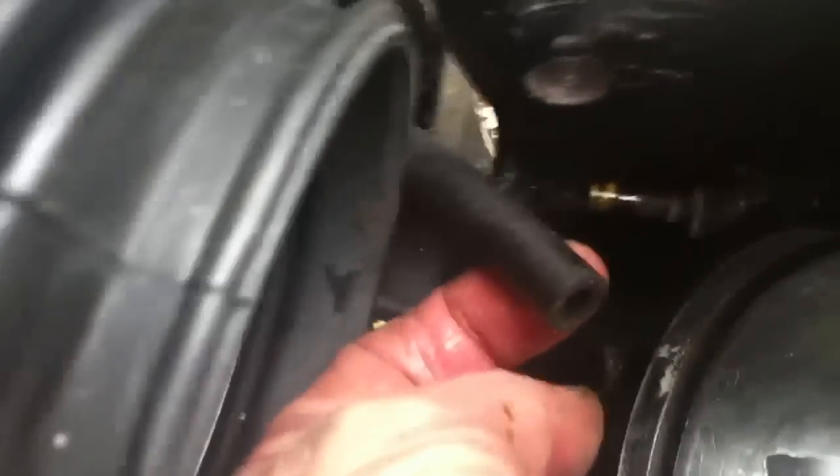Before attaching anything else on the bell housing, I've attached the water pickup at the bell housing - easier to get to now than later. Next I'm going to attach the oil line, then the UJ bellows, then hopefully the exhaust bellows. The oil pipe connection is done using two cable ties rather than a plastic clip. I couldn't risk using a jubilee clip in case it interfered with the UJ bellows and caught it making a hole in future. I'm trial fitting the UJ bellows now - it fits into a ring inside. Trial fit first so you can see what you're looking at and know what mark it's going to. Don't fit the hinge pin yet either side because you want to be able to push the bell housing further in rather than stretching the bellows out to the bell housing.